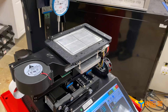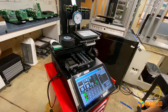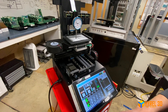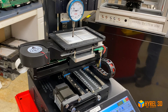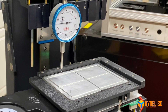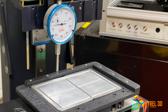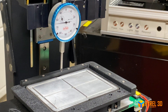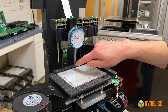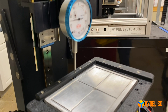I'm going to home my X and Y, then jog over with X and forward with Y. The pivot point is in the rear center, so I'm going to walk this up to just over the center. I want the tip of the gauge to land on the flat spot in the back. That looks good, so now I'm going to drop my Z.